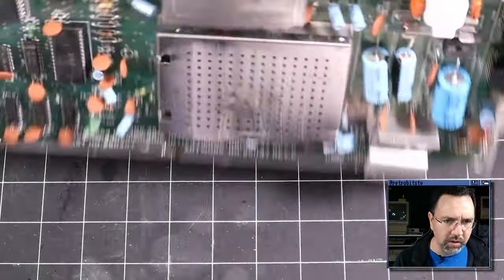And this is an NTSC machine, which means it can't run all that many of the really cool demos out there. But I can load this file into the REU, and then let's just run this program. There we go. This thing does crazy amounts of DMA transfer from the REU into main memory in order to do that rotating globe animation. So you know your memory is working properly if this thing runs. Plus we've got good SID music on the backing track.